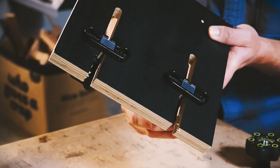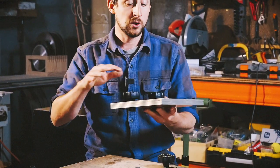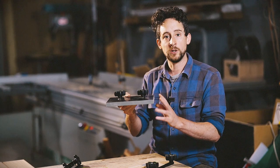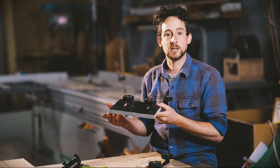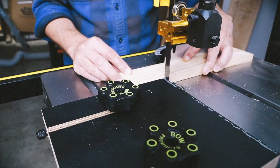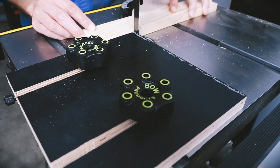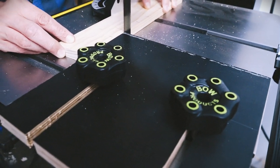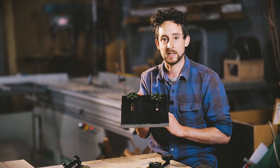This next jig is also a depth stop but a little more complex — it has two slots and was designed specifically for the bandsaw. By using two locking devices in the miter track, it gives you a much firmer hold and allows you to extend that stop much further out than you could with just a small chunk of timber. You might use this on the bandsaw when doing a bunch of dados that all need to be cut to exactly the same depth — run this behind the blade, bring your work up to that depth over and over, with no risk of it moving because it's locked in two locations. You can also adjust both the distance from the blade and how far it protrudes past the blade.